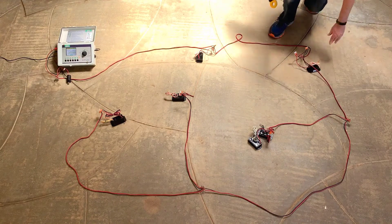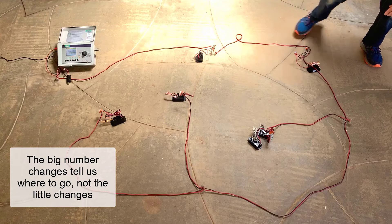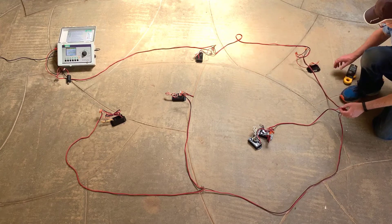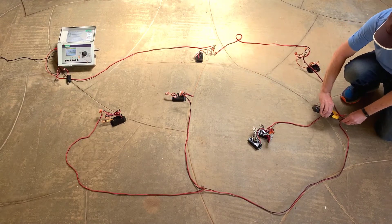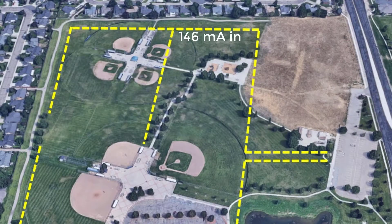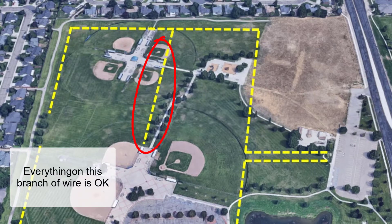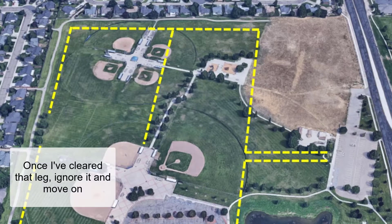Notice that the reading changed just a little bit. On real-world large systems, that number will vary even more. It's those big number changes that tell us where to go, not the little changes. At the next three-way splice with no devices, it reads 146 milliamps high going in and 146 milliamps high going out. We've just cleared that leg of wire going off to the left. Because it's high going in and high going out, we know the problem is downstream — there's no reason to go down that branch, and all those devices on it are okay. It could be a section of wire two feet long, or 2,000 feet long with 100 devices. Once you've cleared a leg, ignore it and move on.